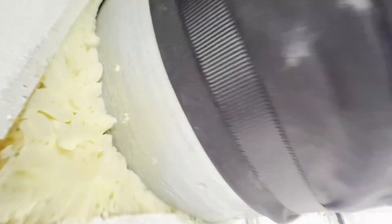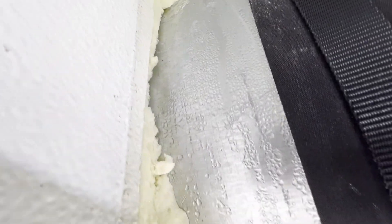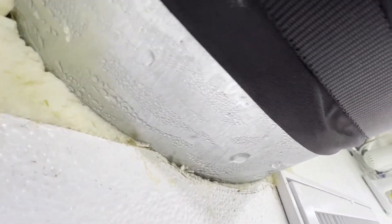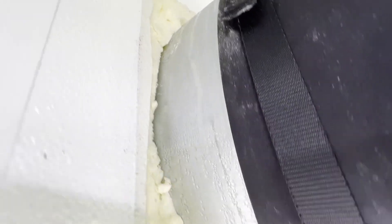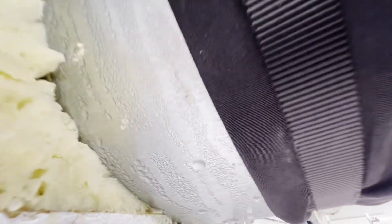In contrast, non-permeable material like metal is going to come down to temperature and result in condensation. When you work with a quality manufacturer like Fabric Air, they're going to make sure that their product has permeability to avoid condensation like this. But it is absolutely possible to purchase fabric duct that is non-permeable and will condensate like this. So a small factor like permeability can have a very big outcome on what you experience with the end result.